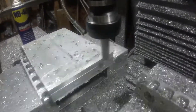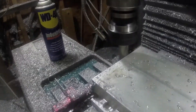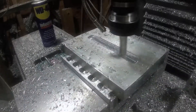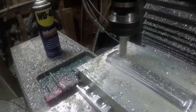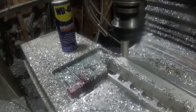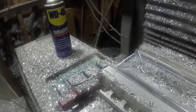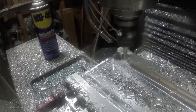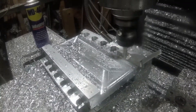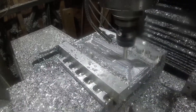For today's project I've got a piece of 1 inch by 5 inch aluminum bar in the mill and I'm just squaring up the cut edges. Then we're going to rough out a pocket in the middle here to get rid of the majority of the material that has to be taken out. And then roughing out the recesses for what I'm going to call the fixed jaws. Then a finish pass on everything.